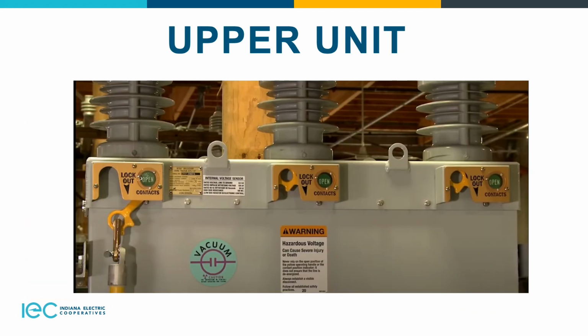So when you do open the recloser, you can also manually open it. There are 3 screens where it'll show a display of each pole, especially if it's a single triple. You can open one individually or all 3 at the same time. So if it is set up on 3-phase lockout, then it will open all 3 whenever you hit the trip button.